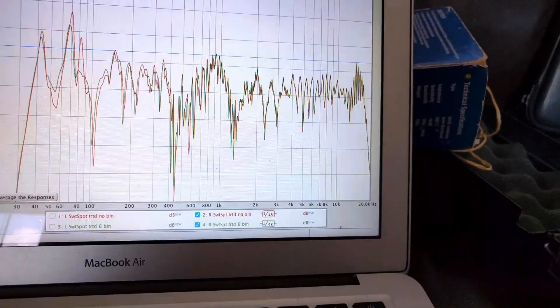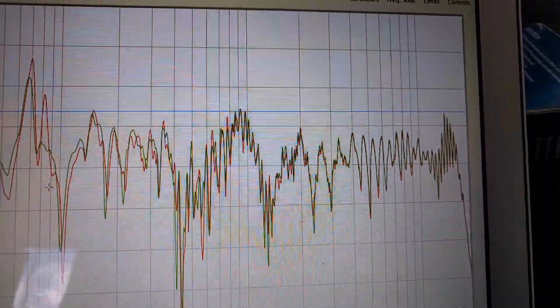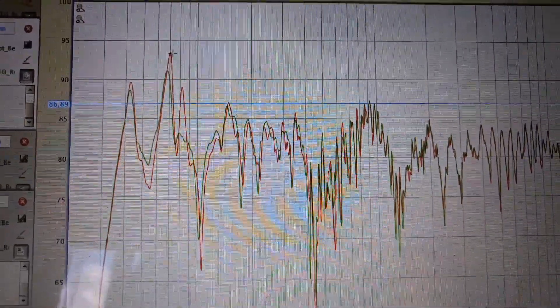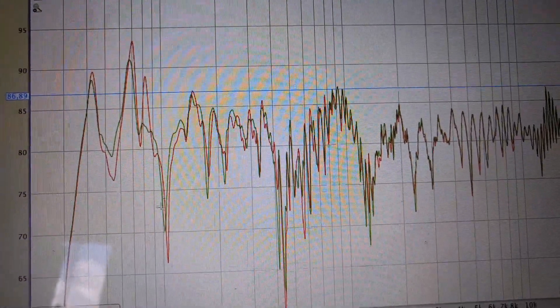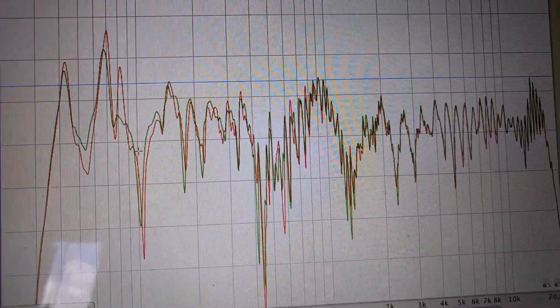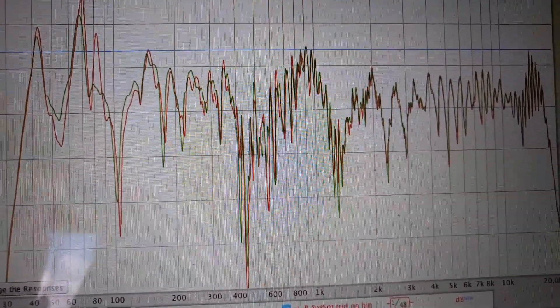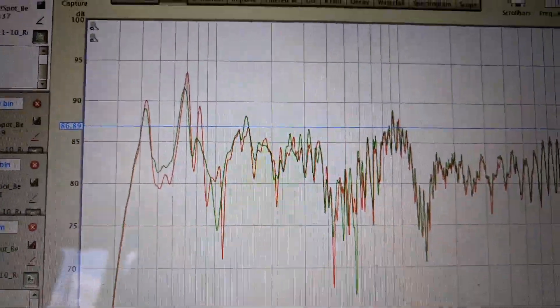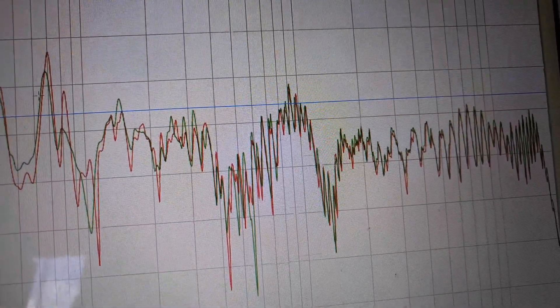So I'd say that's a really good result. Looking at the frequency response — here is before and after for the right speaker. In the top end, nothing really happens. But in the low end, we got a bit of a reduction in the peak. The red is before and the green is after. We got a reduction of the peaks, and that dip came up as well. This here is obviously a reflection-based cancellation — possibly the floor — so we'll have to look at that in more depth. Left speaker before and after — same result: the peak's coming down, the dip's coming up. I'm really happy with that. That's actually a really good result.